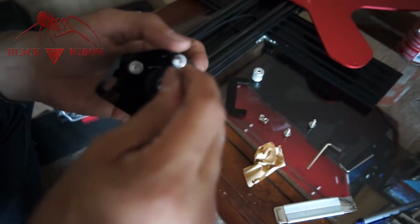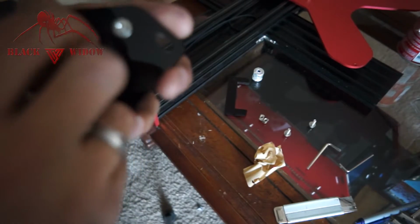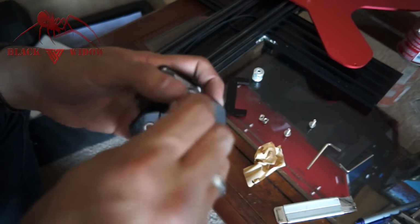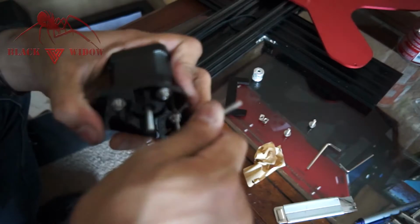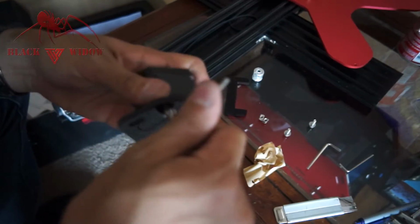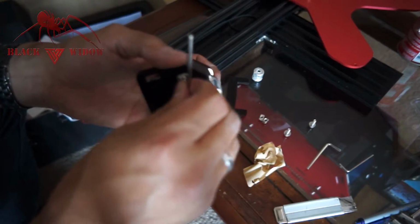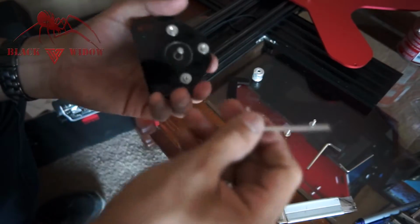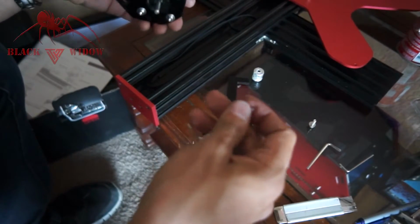Always worth having. As you can hear, these washers are preventing the acrylic from squealing when you tighten it, which is a sure sign that there's some fracturing going on, some micro fractures. Even tightening them really tight, I'm not getting that sound, and that's always good. It's always good to put these washers on anything where you're using acrylic. That'll prevent your thing from cracking. Eventually, hopefully, we'll be able to make these in metal, and then we can get rid of these acrylic ones.